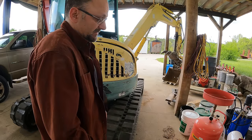Let me do a shout out to heavyequipmentforums.com again. I posted this on there and man, those guys are great. They really thought through the problem and pointed out one thing that I was overlooking, and that is that the pump could still be the issue. P1 and P2 have not really been isolated. I checked the pressures and the pressures were fine, but he's talking about there could be a slight pump bias.